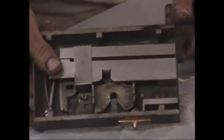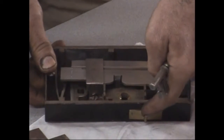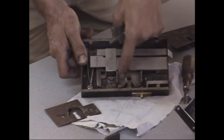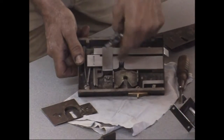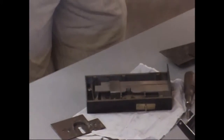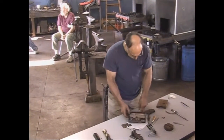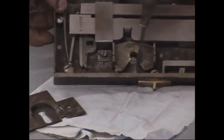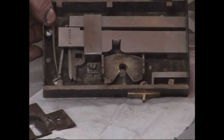So, what was purchased in this lock but from a specialist? The brass parts, all the castings, often the key and the ward plate. And that was called a box of wards. So you would buy from a key maker or a ward maker the key already fitted to its wards. So this one little plate with the wards brazed to it and the corresponding wards in the key.